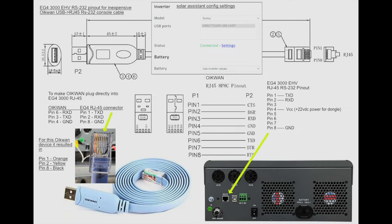So don't just plug it all in — it's pretty simple though. Apparently another change that I'm not familiar with is that now you just need the receive, the transmit, and the ground pin. Those three, that's it. The dongle uses the fourth one — that voltage — to power it, but for these little tiny devices, they already have their own power from the Raspberry Pi and you're just doing communication. So you don't need that extra power source.